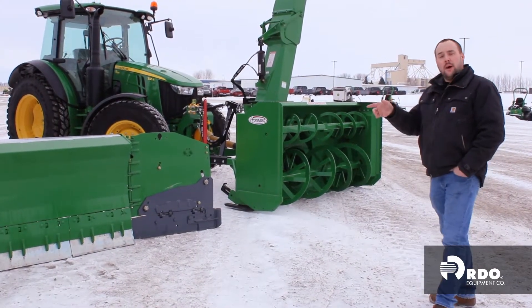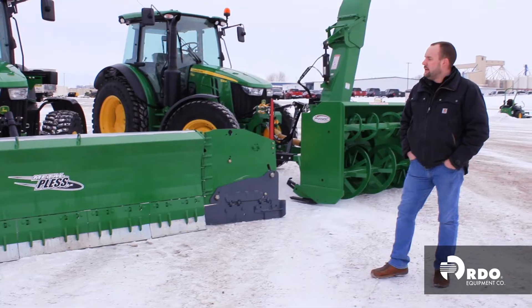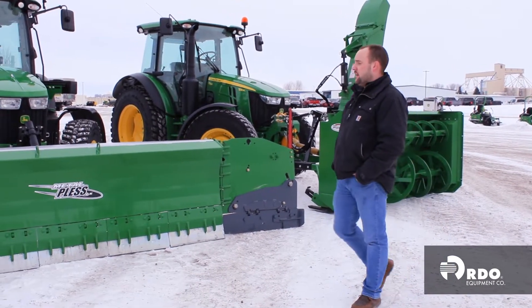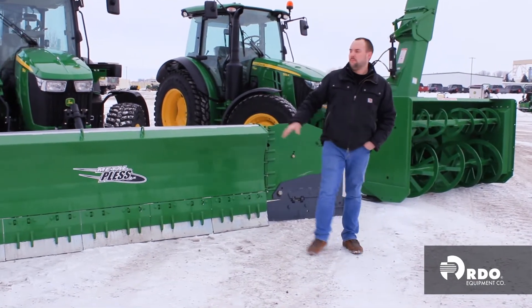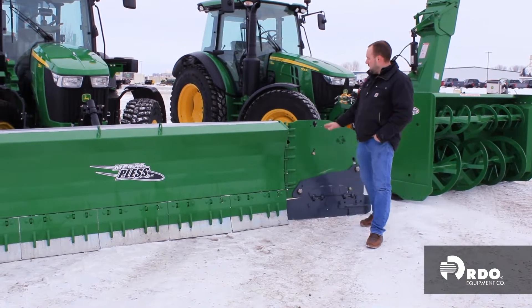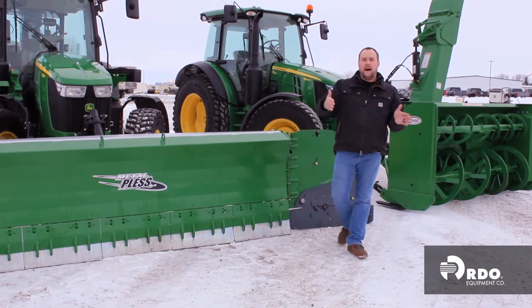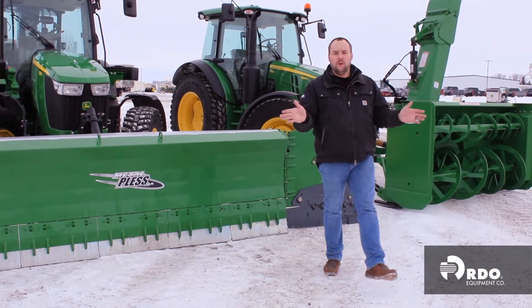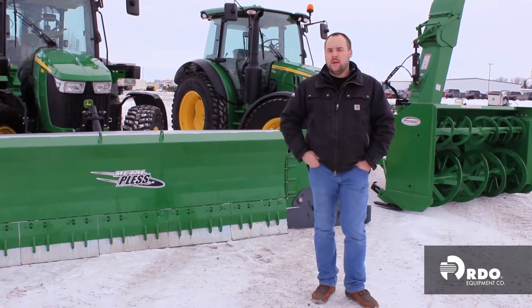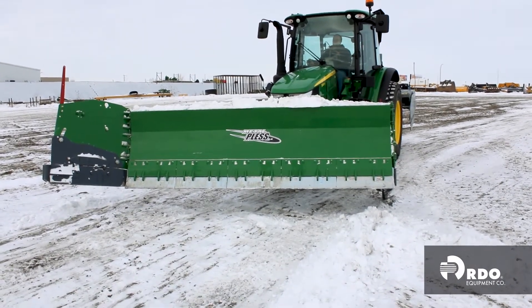On the tractor on my right, your left, would be the MetalPlus 1016 Agrimax. This plow runs on its own subframe exclusive to MetalPlus. This machine has got a 10-foot wide center moldboard, and then to achieve the 16-foot distance we extend the wings. On these wings you are able to go full forward box blade, straight out, or all the way back to a reverse back drag box blade. They flip a complete 180 degrees on both sides and anywhere in between.